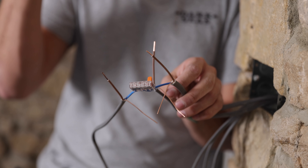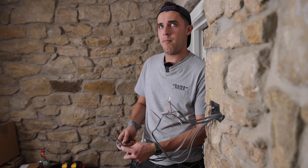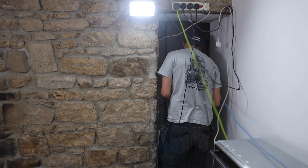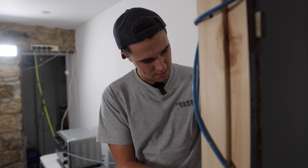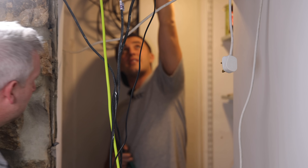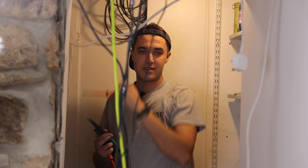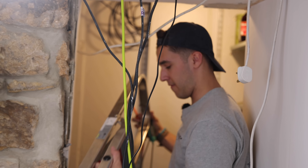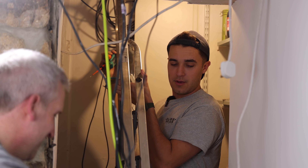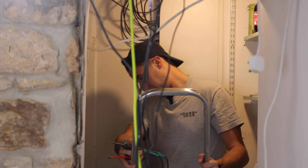I'm pretty sure it goes from there to here. If one of these is live then we'll know. Can't think why there wouldn't be power there — unless the breaker's failed. That's a bit of a freak coincidence if it has, but I'll check. There you are, look — see that light flickering? That's just your breaker that's failed. The light's flickering and all I've done is touch the breaker — I reckon it's just a bad connection in the top. These look like uninsulated steps, but they're insulated — they're just sprayed metal for all the haters. The carbon fiber is made to sound like metal; it's made for the old school tradesmen that used to like working off metal steps. Obviously health and safety regulations now mean that you can't — I'll leave the link in the description below.